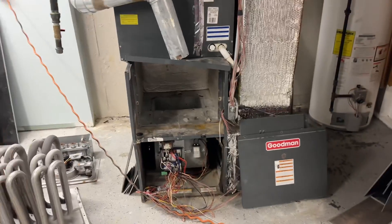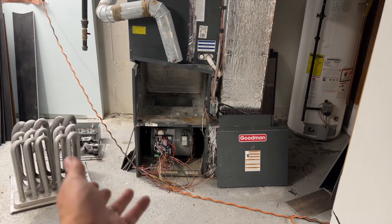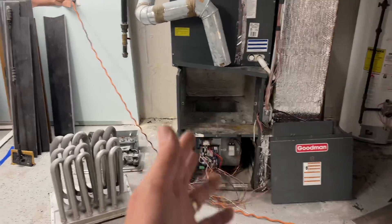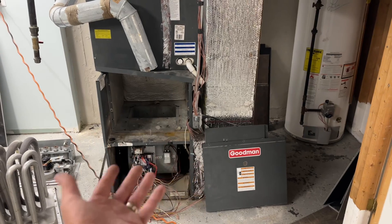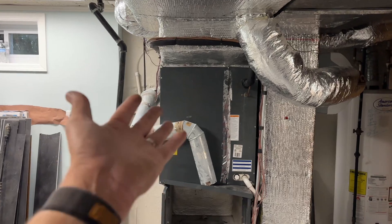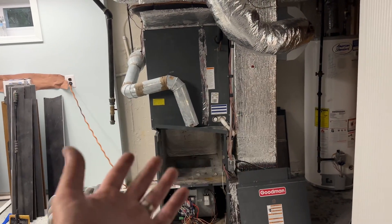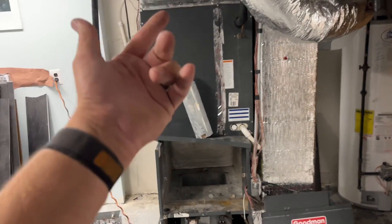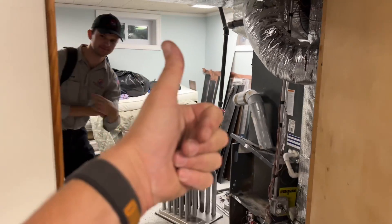The coil is not too bad. I gave him a couple of options. Option one: replace the furnace with something similar at the same efficiency sitting on the floor — which I don't recommend. For a bit more money, upgrade the furnace and put a plenum box below it, elevating it maybe six to eight inches. And for much, much more money, rip everything out and do it in two stages — stage one: heating and evaporator coil, then in the spring, the outdoor unit. Alright Peter, ready to go? Vamonos — smash that thumbs up button!